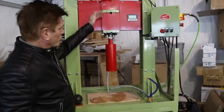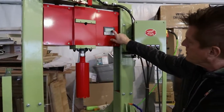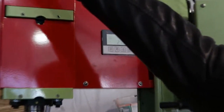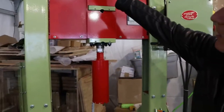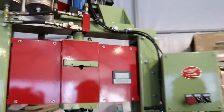And then with the core drill, I'm going to set up and I'm going to come down. If I want to rapid this drill down, you'll see there's a digital indicator here. I can come down to where I want to be drilling. Once I get to that particular place, pretending our rock's in there, then I now have a fine control for being able to slowly control the speed of my cut. Now obviously I'm not set up here.